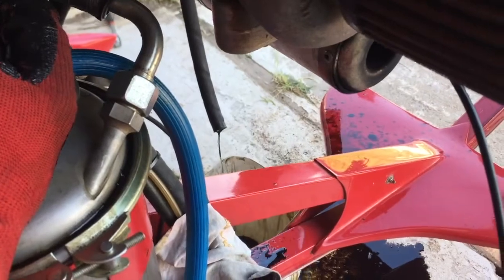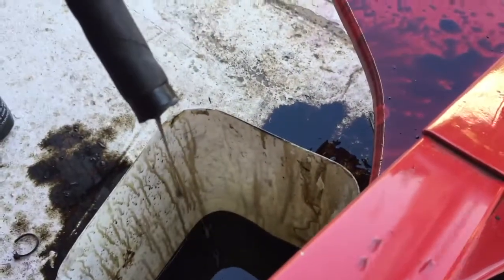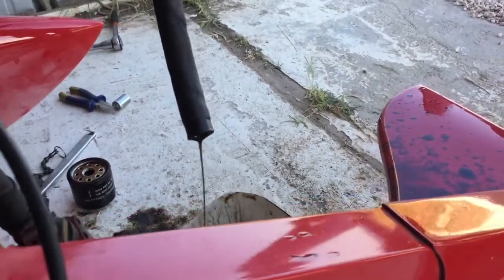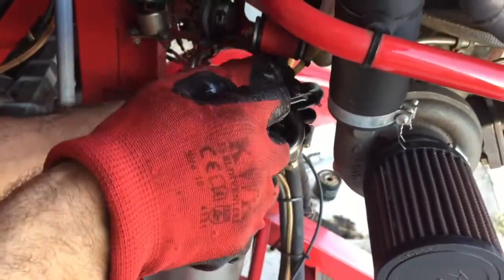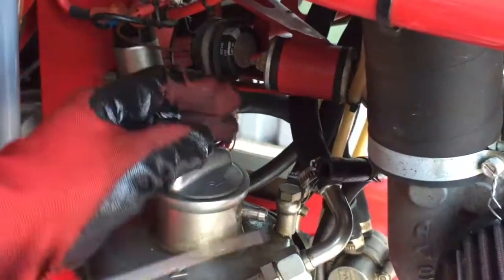Make sure you have enough oil in your reservoir so air is not allowed to reach bottom pickup. Start procedure over if air is allowed into system. Remove pressure regulator and refit both lines to their original positions on the reservoir.